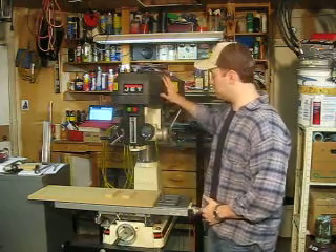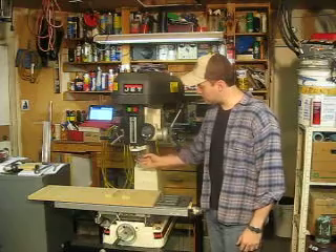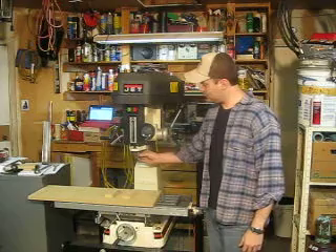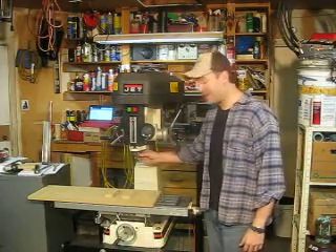I have to change the speed on this because I'm about to use a standard woodworking routing bit — it's a spiral cut bit, half inch — and a half inch R8 spindle taper collet that's actually chucked up into my machine right now.